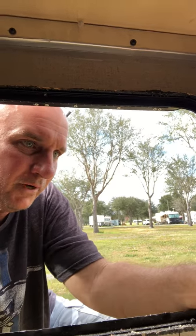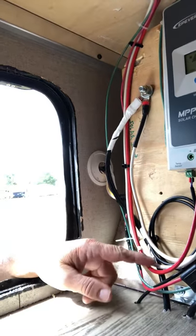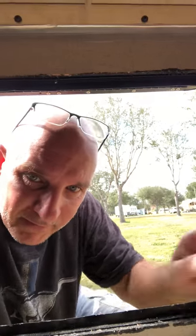The load is on a 15-amp fuse itself. The solar wiring I used was 10-gauge and it's rated for solar panels. You don't necessarily need to use that — you could use something else — but this is UV rated and made to be put outside. It wasn't terribly expensive on Amazon, so just get it.